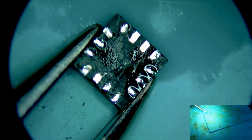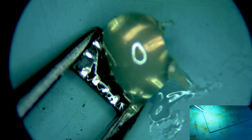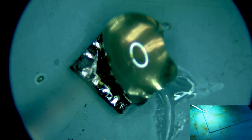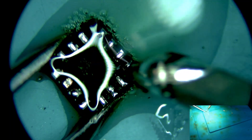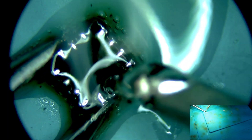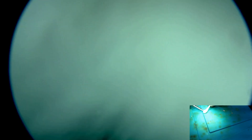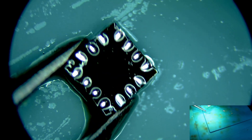Some happy little pads there. I'll put some flux on the bottom, tin up those pads and get them looking good. Take my micro pencil, add some solder, some fume extraction, and put some dots of solder on these pads. Go all the way around and fix up all the pads. This chip looks like it will be fine. We just have to get it onto a donor board.